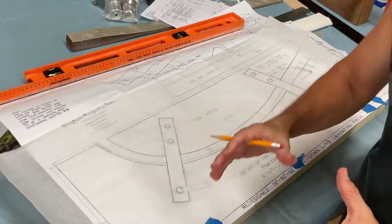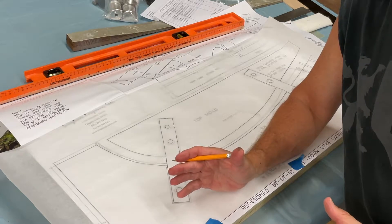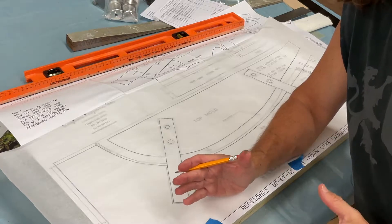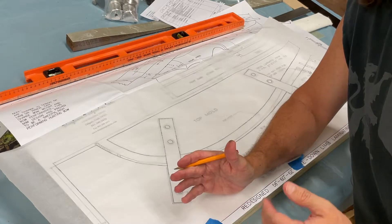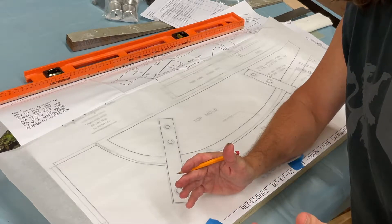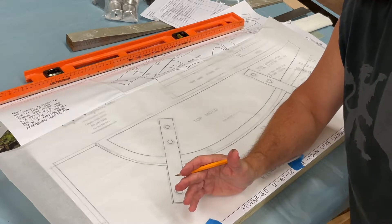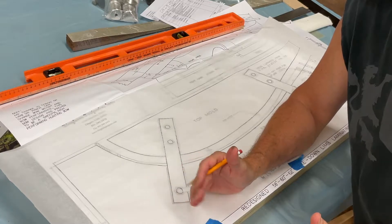The plans call for a half-inch board cut to around 12 by 30 inches — four of them laminated together gives you about two inches. But I'm building a one and three-quarter inch wide bow, so I need 1.75 inches. I've got a three-quarter inch, a half inch, and another half inch of plywood, but that's still a little shy. Someone on Trad Gang suggested ram board — my daughter had a sheet, and two pieces of ram board sandwiched in brings me right to 1.75 inches.